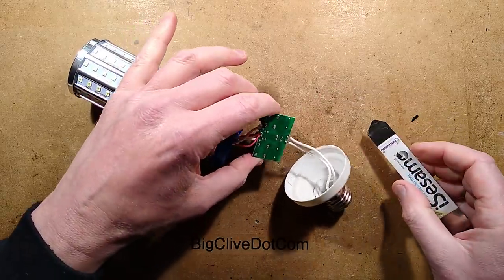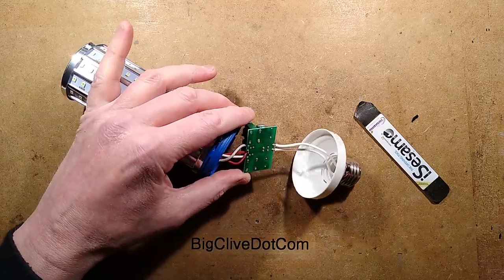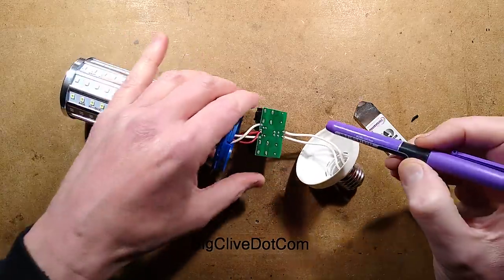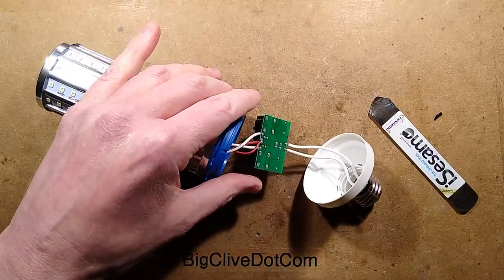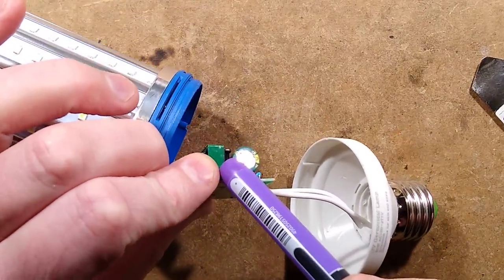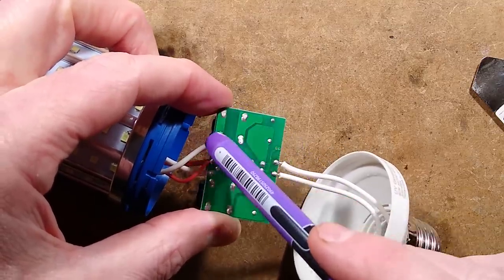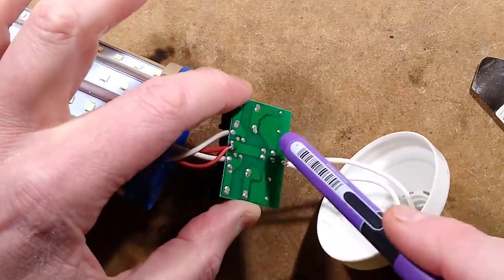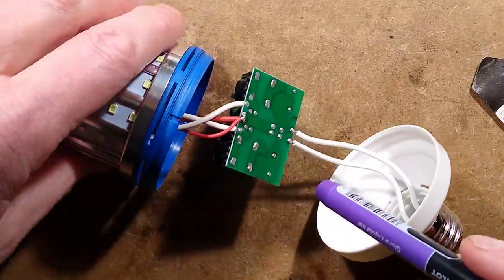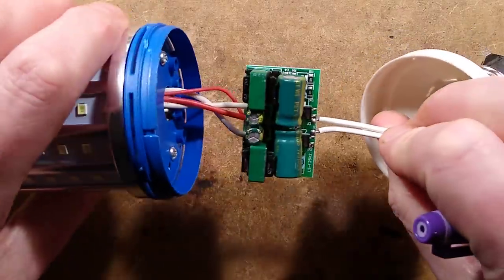I should be careful here because this does have big fat capacitors. It is just inductors. I'll zoom down a bit in this. You've got the inductor here, and then it's got 1, 2, 3, 4 pads, but they're commoned in pairs. So that is purely an inductor. That's why it was passing mains straight through. There's two complete power supplies. It's driving them as two sets of lights.